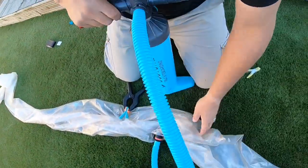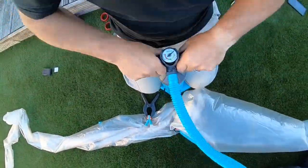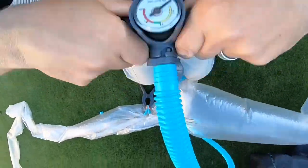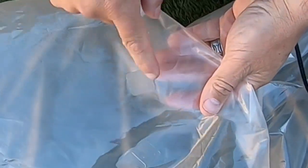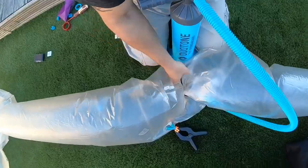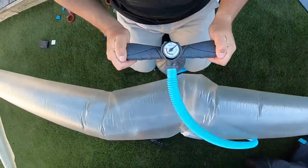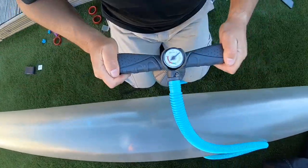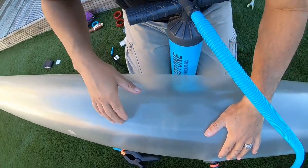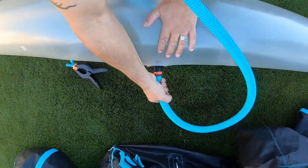But what we also then do is a soapy water test. As you can see here, these are the ones I've previously done, so they've held quite well. There's nothing to support this now, so you could put too much air in and end up bursting your bladder, so you've just got to be quite careful with it. So detach it,